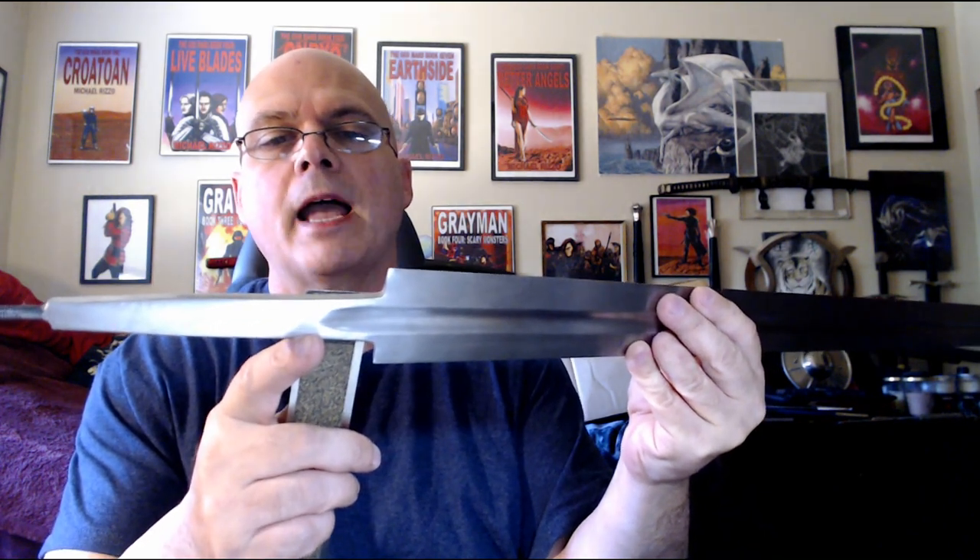Nice tip, nice plane. It's got a fuller that runs three quarters of the length of the blade. 1566 steel came pretty good looking out of the box, so don't have to do much to it. Maybe give it a bit of a polish because it is kind of a wire brushed finish. Overall length of the blade is 31 inches with a six and a half inch tang, which includes about an inch and a quarter of threads. The tang is a quarter of an inch thick, so that's pretty beefy, and it's got a nice distal taper all the way down to the point. Width of the blade at the base is two inches.